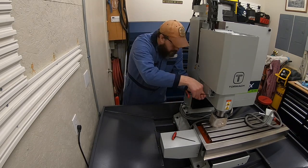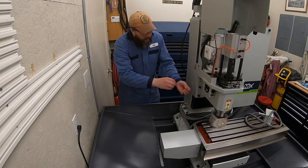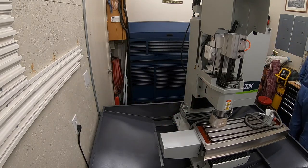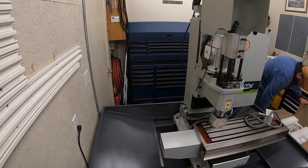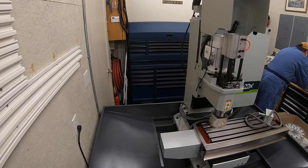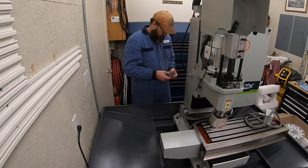I would say it went nearly as smooth as the video they put out there. The step-by-step instructions in the book are also really, really good. You go through, you pull off the original air button actuator for changing tools, pull out a couple of those original air lines, get all of that cleaned out. And then next step, you go over, you pull the studs out of the column that are in there. Mount those four big mounting bolts that they give you. One thing that was interesting, those mounting bolts, it's actually a stud, and that big nut that you're looking at there is completely separate, and it spins on the studs.